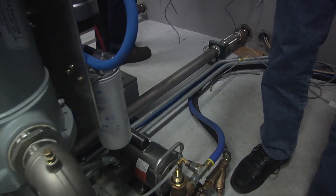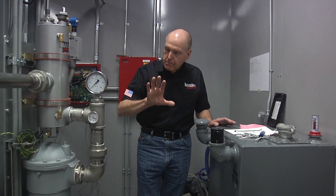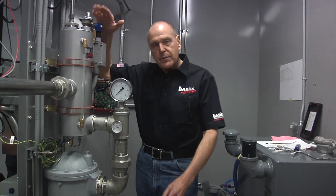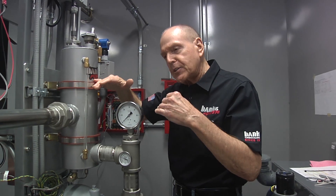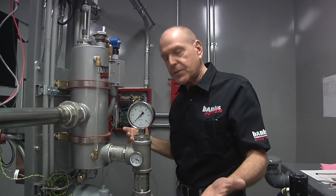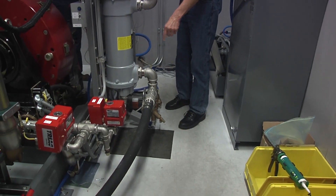Down on the floor is a pump that allows us to fill the engine once it comes in here. This pump system draws coolant out of this tank, fills the engine. We then valve it off, and now you're on the tank. We pre-pressurize — this is like the upper tank in a radiator — to upper operating pressure like you'd have in the truck with the pressure cap. But we build the pressure before we even start the engine. We run the 22-minute dyno test, then pump the engine out back into the tank, and the engine is ready to ship with the coolant out of it.